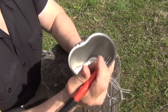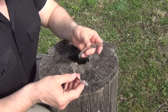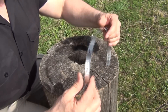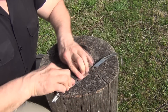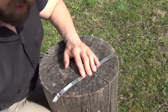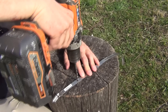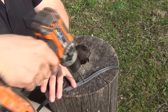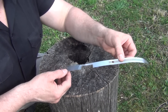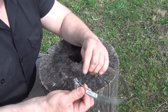Next we take the hose clamp off and disassemble it, then flatten it out so we can see where the marks are. You may want to wear a glove to do this. We're going to take a drill with a 7/32nd drill bit and drill out each of these holes — one here and one here. Once you get that done you're going to have two holes, and it's going to look like the hose clamp. Then go ahead and put it back together.